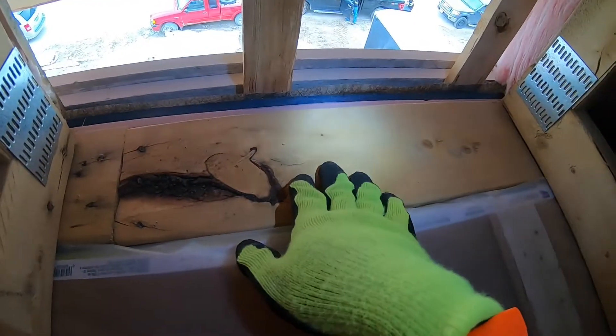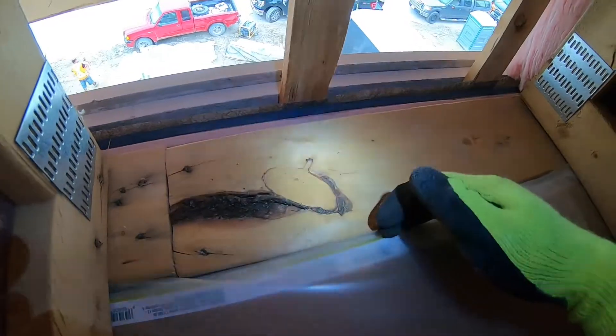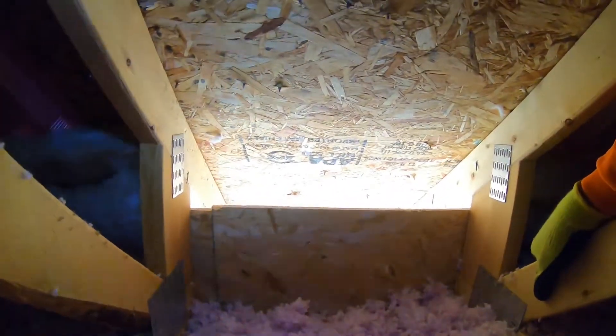A smaller detail I wanted to show: this is the top plate of the outside wall, so it's a two-by-six, which is typical for most homes. If you're going to build your plywood wall, you want it on the outside, not the inside — I've seen that mistake often. That way insulation can cover the actual top plate. This plywood border holds resistance from the wind, so when the soffit isn't installed, this sheet of insulation can be pushed in and won't push out into the attic unless there are massive winds, reducing the chance of wind damage in the attic.